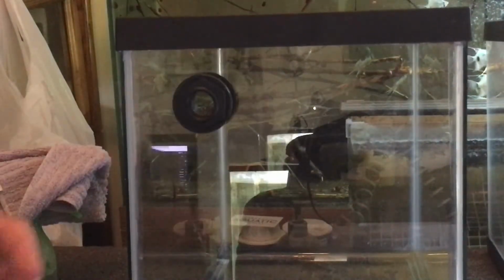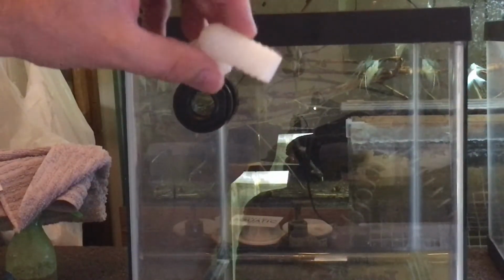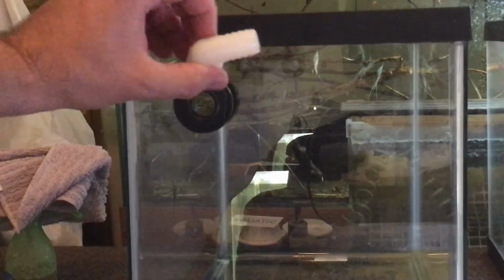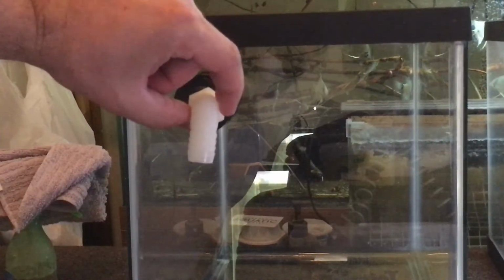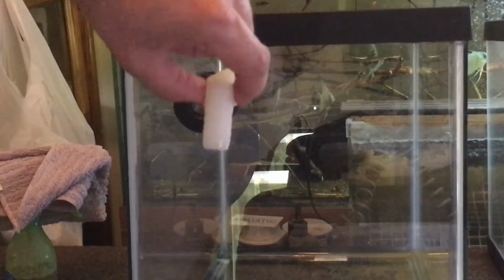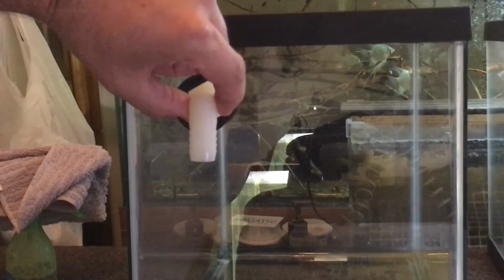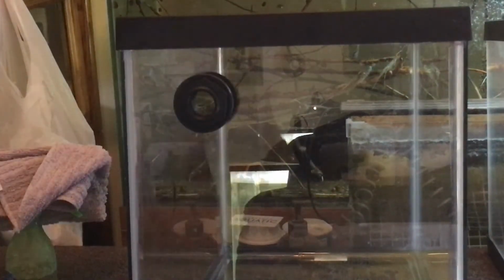The reason you need to put this in now is this doesn't get tight till it's all the way bottomed out. And if you already have the bulkhead tight and then you thread this in, it could end up upside down. So you need to get this piece tight first in the bulkhead, and get your angle, and then hold that so the bulkhead doesn't turn. That way it drains properly and you don't have an upside down drain. So we're going to do that now.